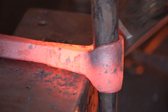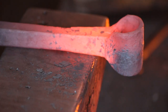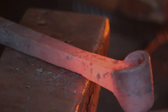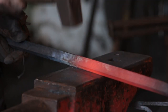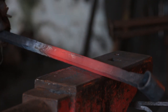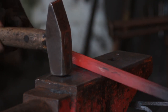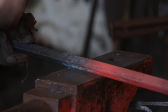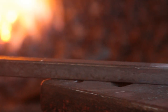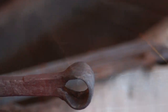The drift I'm using is slightly larger than I want it to be, so I'm only using the tapered section. That means turning the eye over and coming in from the other end as well — basically working the eye from both ends. With all that done, I will knock off the square corners, take any sharp edges off anything that might be uncomfortable to hold, and just smarten it up. So here is the welded eye — very smart if I say so myself; I managed to do it without burning anything.